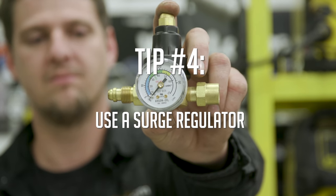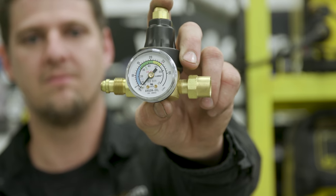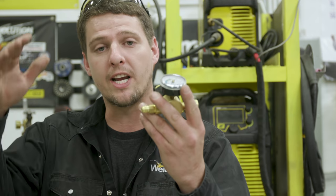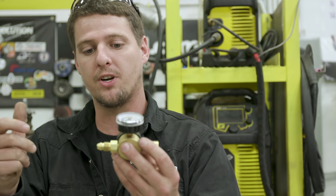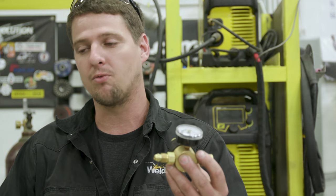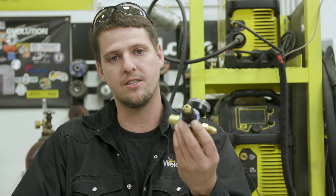The fourth and final tip is a surge regulator. Basically, when you pull the trigger on your MIG gun, you get a blast of gas. That blast comes from between your solenoid and your regulator — pressure builds up, and even though it reads CFH on your regulator, you're actually building about 80 PSI in there. What the surge regulator does is regulate that PSI buildup, so when you pull the trigger and the solenoid opens, only a low, controlled amount comes out — no big blast of argon or 75/25. It mounts right underneath the regulator with two adjustable wrenches in seconds.